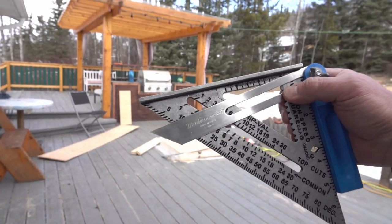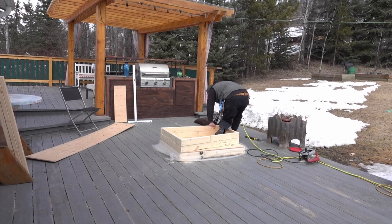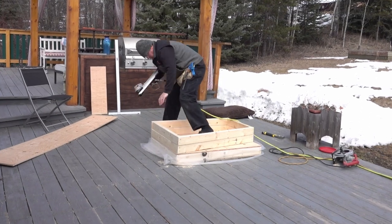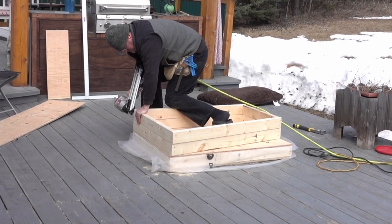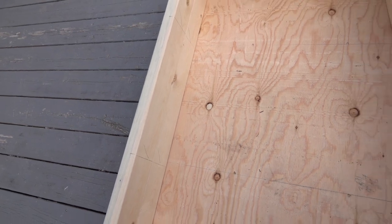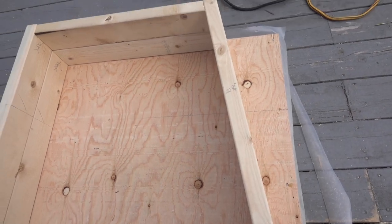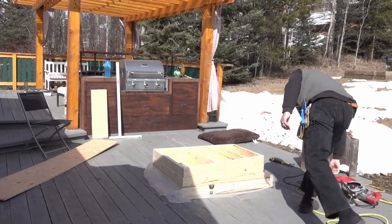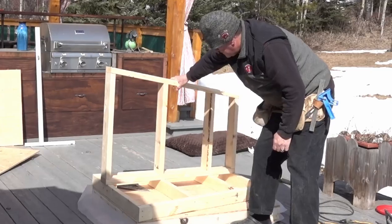I used 10 degrees as the angle that I wanted for the shed style sloped roof. So with my bevel square set to 10 degrees, I set about framing the two sidewalls. I found stacking the walls on the floor provided some good reference to square, as well as saving my back somewhat. There you have it, a framed wall.